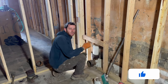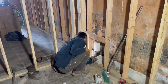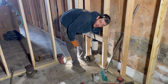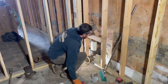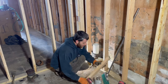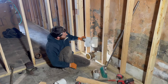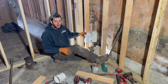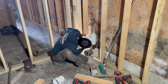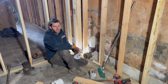You want to make sure the PVC bottoms out into the bottom of that hub. I felt it seat but I'm going to double check — put your hand down in there. It's bottomed down real nice. Take your temporary bracing back off. Now that I'm in the hub, I can make my cut for whatever I want. I want to put this T in here to pick up the laundry line down the line. I'll mark it and then we can make our tie. That's how you tie in four-inch cast iron with PVC.